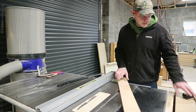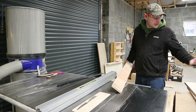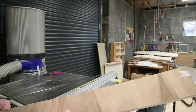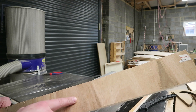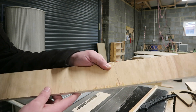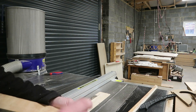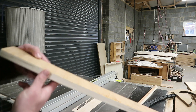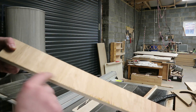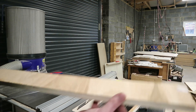I'm going to set this to three inches — 75mm — and get these through, and use these bits as strips, just straight through like that. Notice the difference, and this is why it's important especially when you're going against the grain on plywood: you can see how smooth the cut is here, and then how rough and chipped out that is, just because the blade wasn't far enough up. Really, you want a minimum of about a quarter inch of the blade above the material — go for a quarter to a half inch — and the difference between not having enough blade poking out versus having just the right amount is significant. Look — perfect.